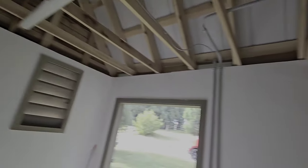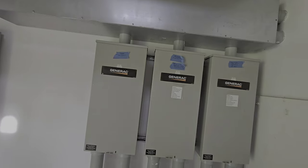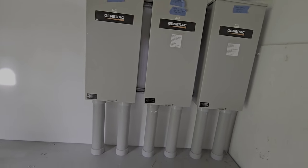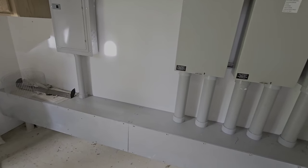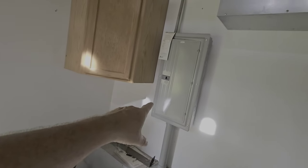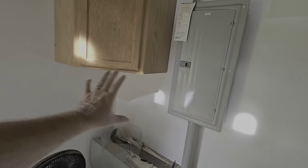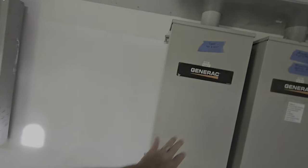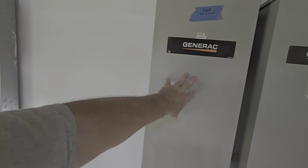We were able to take all the panels off the buildings, and the buildings become a sub-panel, basically. But this has been an awesome setup. So if any of you are thinking about doing something like this, this is kind of how you set it up. That's a trough for all your lines going out. They go down the ground and go to the buildings. Like I said, this is just a non-generator backed up power, which we could hook to another building if we didn't care about there being backup power. This is a spare, so it works, but there's nothing hooked to it, and that's 200 amps.